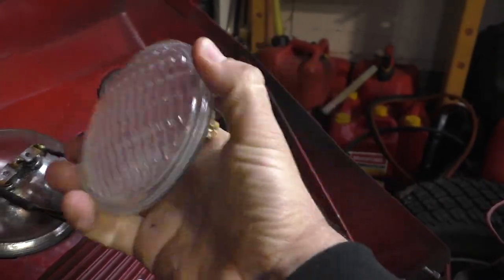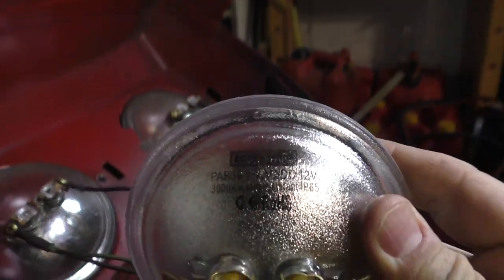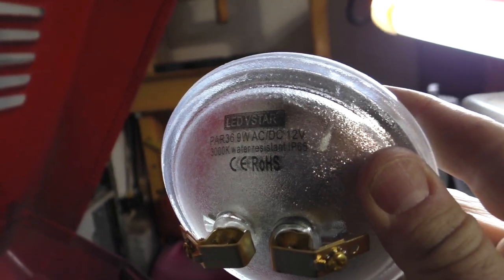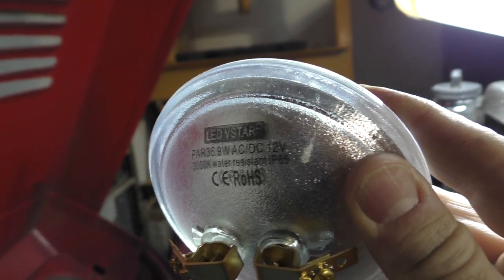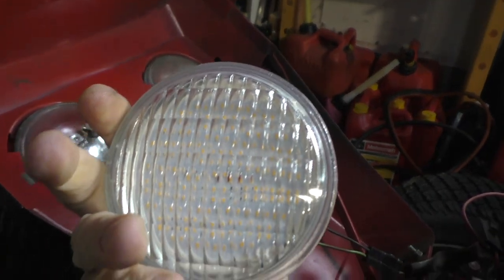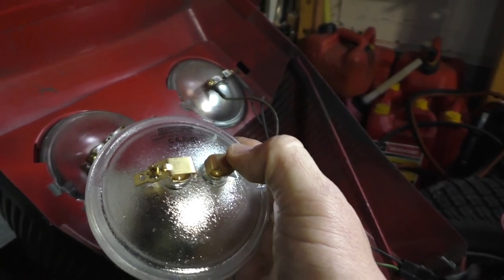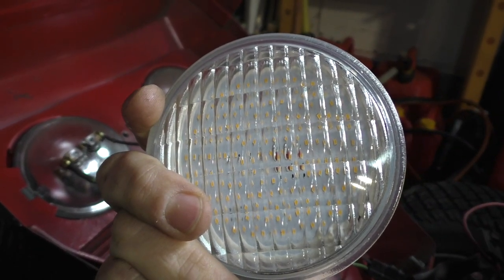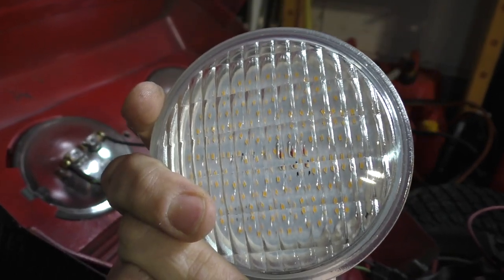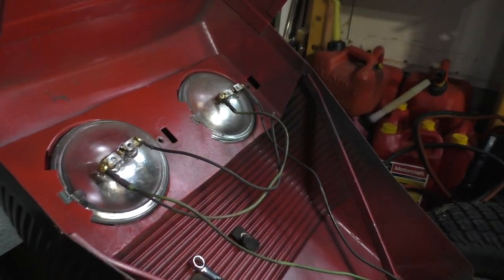So what I've decided to do is replace them with a comparable LED. They're basically the same size but heavy with a glass lens. They are 3000 Kelvin, water resistant, 12-volt PAR 36, 9-watt AC/DC lights — basically a landscape light you'd put in your yard shining up at a tree. They're 9 watts each, so 18 watts total, but they allegedly throw 50 watts of light output as opposed to 35.